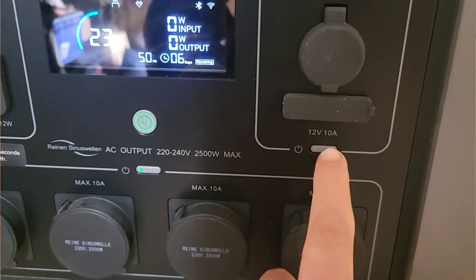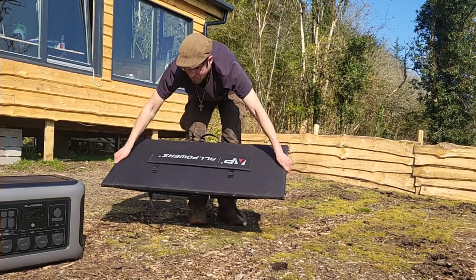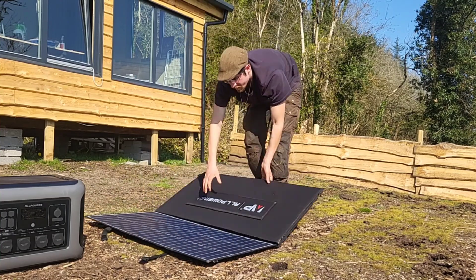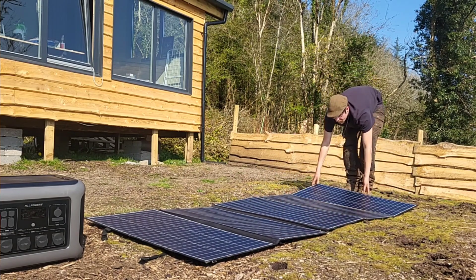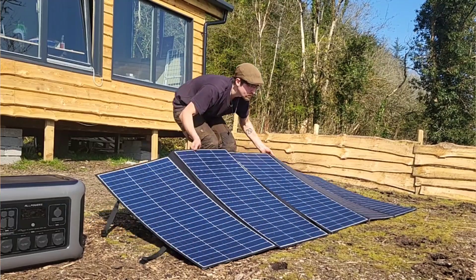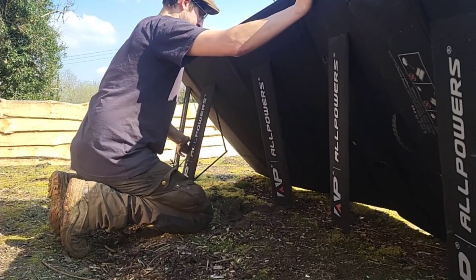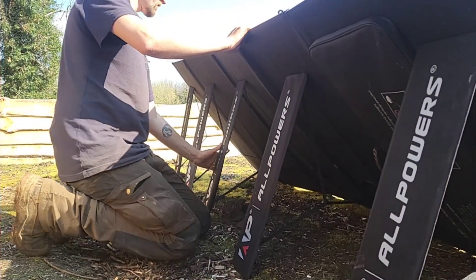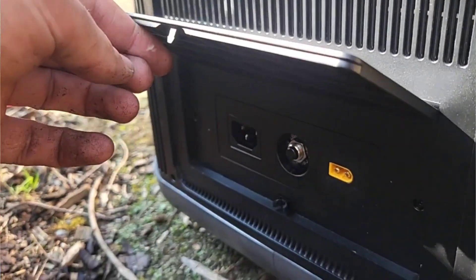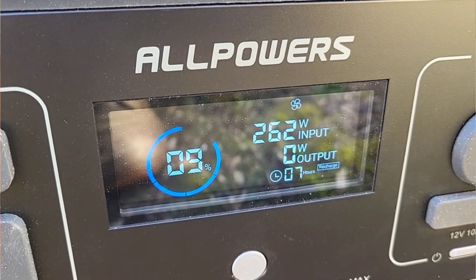What I like is that you don't need to baby it — it's built for proper work, it's plug and play, and it's just ready to go. The 400-watt solar panel folds up like a big briefcase. I wasn't sure what to expect — was it going to be flimsy or fiddly? — but it's pretty easy to set up. You can see me doing it here. The kickstands fold out, the MC4 connectors snap in, and you're off. I'll be getting 300 to 380 watts on sunny days, and with a 400-watt panel you're looking at around six to seven hours of full sun to charge back up. However, the R2500 takes up to 1000 watts of solar input, which is huge, so you could recharge in around two hours if you have the sun and panels to match.